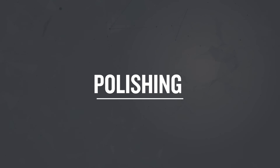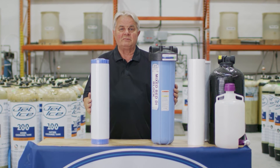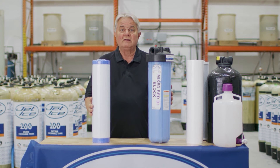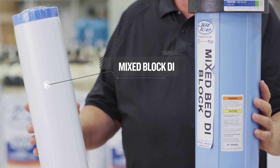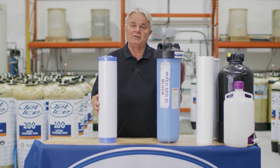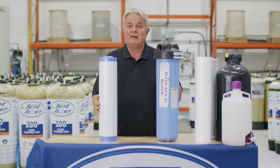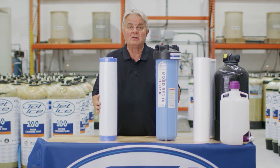We've talked about deionization and RO systems. One issue that concerns top-tier curling ice makers is how to get water down to zero parts per million. The easiest method is simply adding a DI block to your final water for pebbling. This is a mixed block deionizer — it contains both cation and anion resin. Installed in a big blue container, it gives you that advantage: feed water through it at 5, 10, or 15 parts per million and fill your pebbling water can with zero parts per million. Great ice, great water.